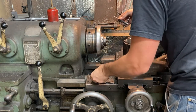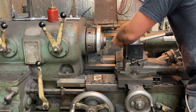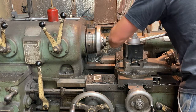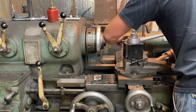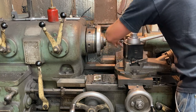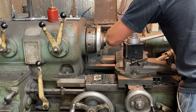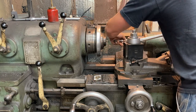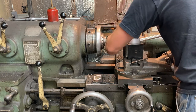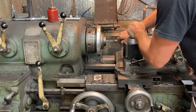It's definitely preferable to like an electronic foot brake or something like that, because those don't actually act that quickly if you're in trouble, for one thing. For another thing, being able to feather the clutch on these is incredible. And then not having to turn the motor off to change spindle speeds. It's all good. Older machine tools, quality ones, tend to have clutches.